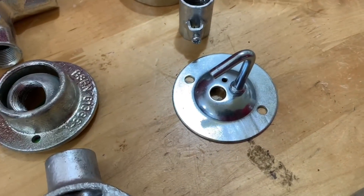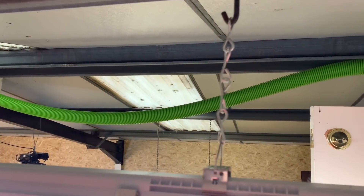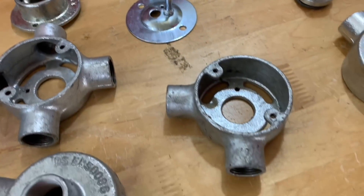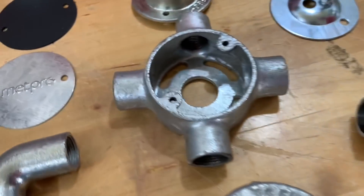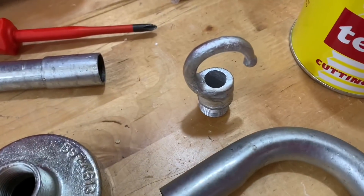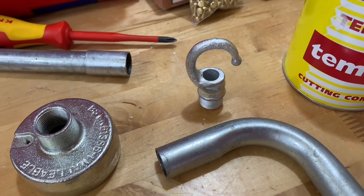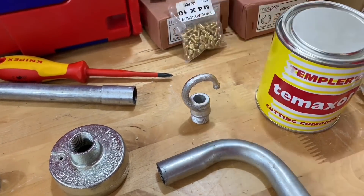Something a bit more familiar in front of it — we've got a hook plate, and we'd normally be hanging light fittings from there, perhaps on some jack chain. And then in front of that we've got an extension angle box, similar to the intersection box we saw, but an angled version. We've also got a male hook at the back — similar to the hook plate, you could go straight into a coupler with that into a piece of conduit and hang light fittings from there.